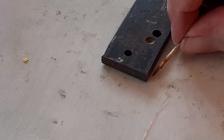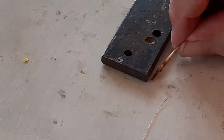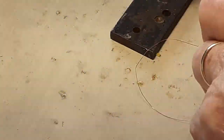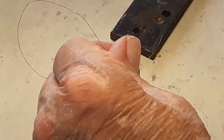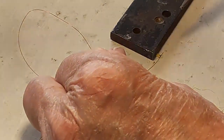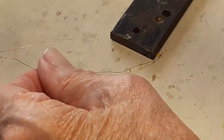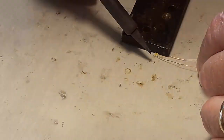Once again, the magnet wire you use should be absolutely clear of enamel. We just lay that piece of wire next to the SMD, touch it, and you have a joint. Now you can bend your wire this way and that. What I do is reposition the SMD so that I can have the wires pointing downward. I then use them to put in lights — street lights, platform lights — and I'll show you those later on in this video.